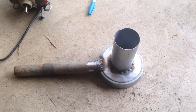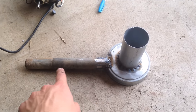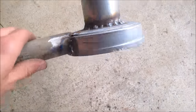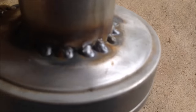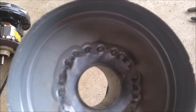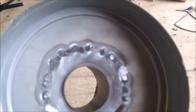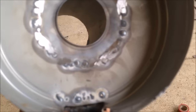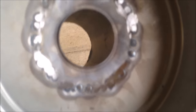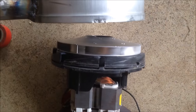I've welded the pipe on right there for where the suction is going to be coming in. I've welded on — I believe at the wrong angle now — the output pipe, but we'll see how it does. All I've got to do is snap this thing onto the front of my motor like this. I had to very gently spot weld this — very gently — on the underside. As you can see, I never burned through it, but most of the welds came really close, so I had to grind them down a little bit where they kind of bulged out. But that means I've got good penetration at least, and it probably won't crack unless the whole shroud rips apart. I ground them down because this is a very tight tolerance to the front of my fan right there — I don't want to rub it against the fan.